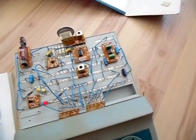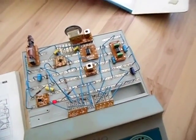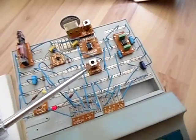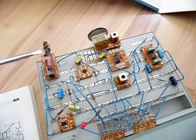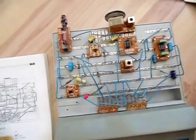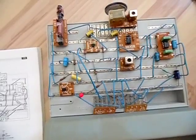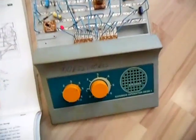It's like a siren. However, I managed to get it running — don't touch these connectors during the video. The second issue was I wasn't receiving any station. I adjusted the IF transformer to 455 kHz, then adjusted the tank circuit of the antenna coil and tuning capacitor. As I did that, it got more and more sensitive, and I think I've got it pretty much at the top of what can be achieved with this circuit.